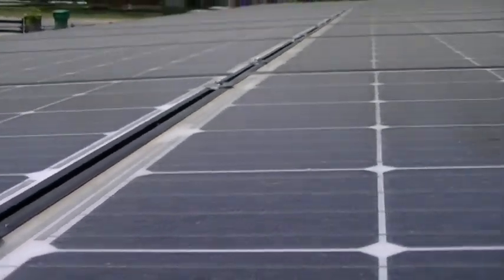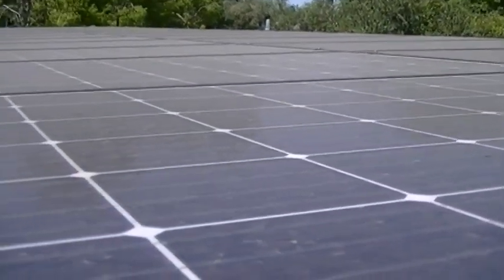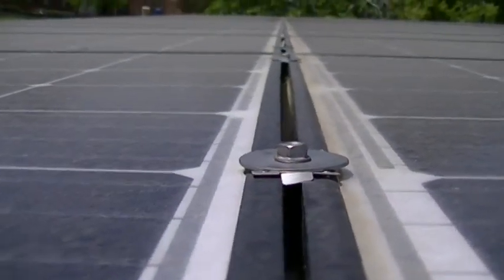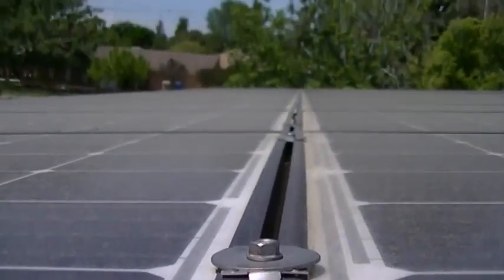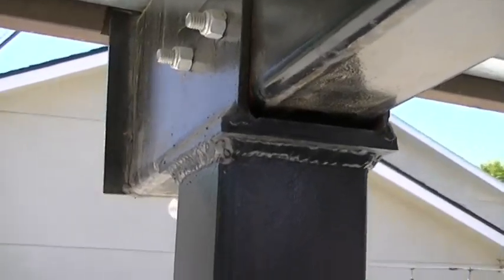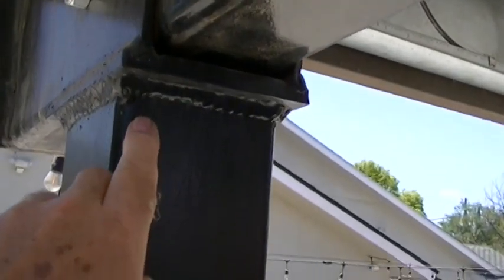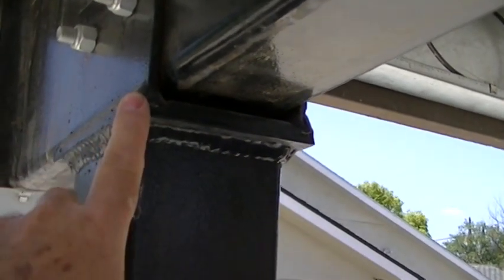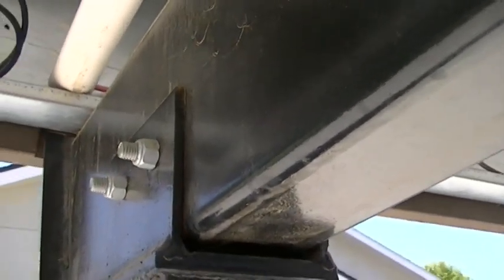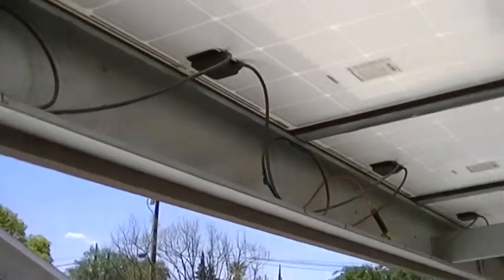Here is the system from the end view — panels are a little dirty, but these are Q-cell 300-watt panels, 39 of them. You can see how straight and true the system is by looking down that line — that's a real important key when building shared rail systems. These are custom-fabricated cradles that cradle the four-by-eight beam into the four-by-four post. Everything is custom welded, with half-inch bolts bolting through — that's how we do the beam attachment to the post.